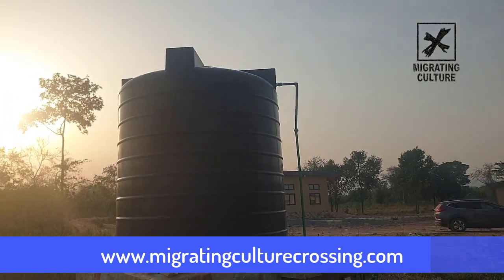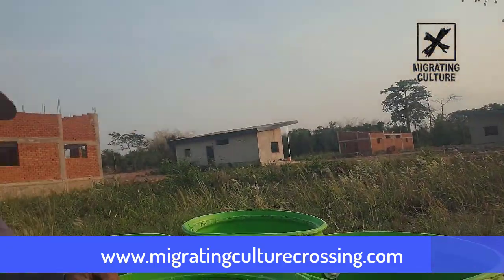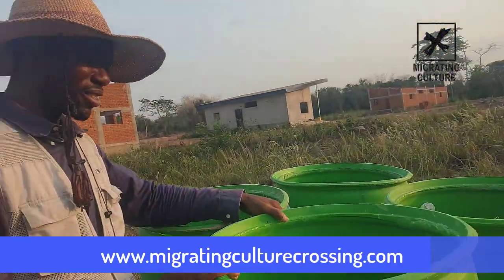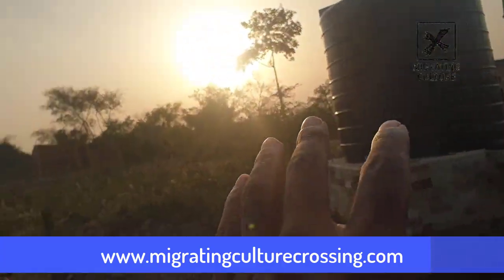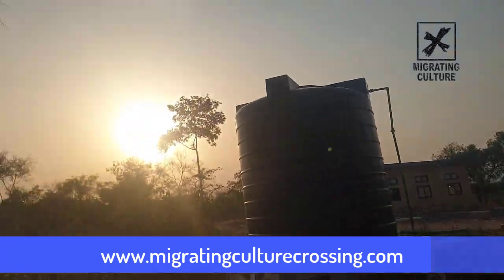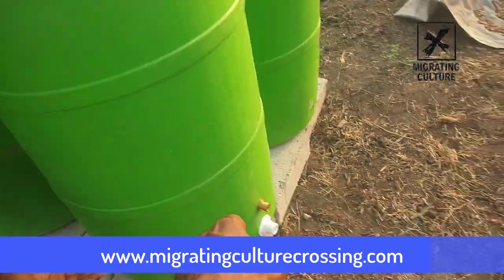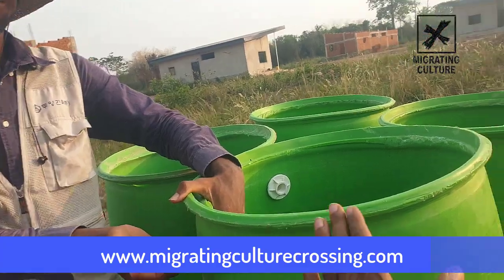So basically it's the same method used for the valve on the main poly tank that shuts it off — just that this one is at the bottom with a thread and ball that rises to the top. This barrel doesn't have that trap because the inflow is at the top. You put the inflow at the top, and the outflow at the bottom, so the water must filter through the media from top to bottom.